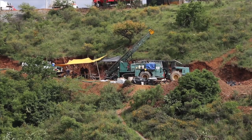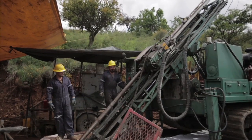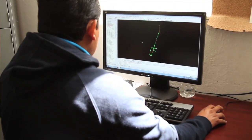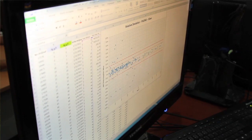This is done with surveying. We use professional surveyors who will angle the drill. From the surface you can generally go up to about 45 degrees, between 45 degrees and 90 degrees. You're trying to build a three-dimensional picture of what that vein is doing inside the earth, anywhere from 100 to 500 meters below the surface. The thickness is absolutely critical — if you have something that's only two centimeters thick, it'll probably never be a mine.